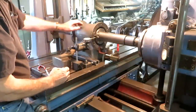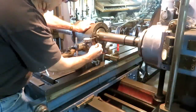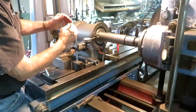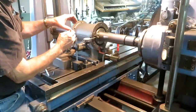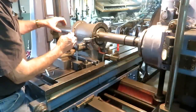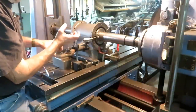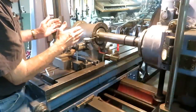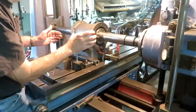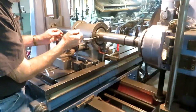One thing that's kind of important with steam engine cylinders is there's a relief, a slightly larger diameter relief that goes in on this cylinder, about maybe 3/4 of an inch on each end, and the piston rings actually run over into that relief slightly on each end in order to keep any kind of a ridge from building up as it wears, which would hammer against it if anything in the bearings were changed, like taking up the rod bearing would make the rod slightly smaller or slightly longer, which would make it hit those ridges.